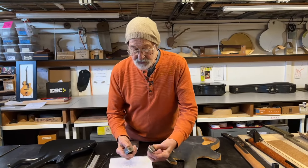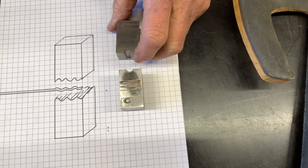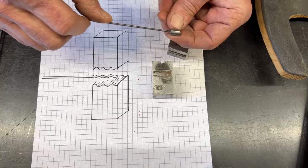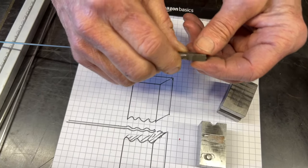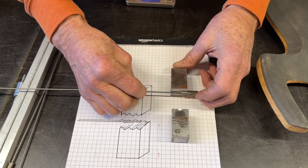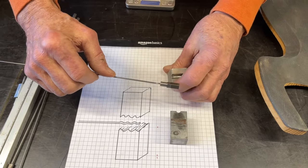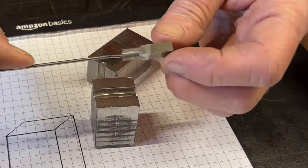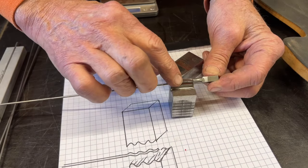Back to the swaging idea. This is a set of swaging dies. You'd need probably at least 20 tons — maybe more. I think our press was 50 tons, and I never knew exactly how much pressure we needed, but we ran it full tilt. This part started out as a square piece of material. This is 4140 — a semi-tool steel, alloyed so that it can be tough — used for high-stress applications. I believe it's specified for a lot of car axles.